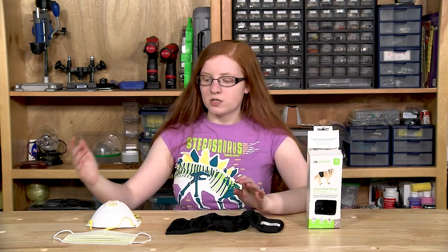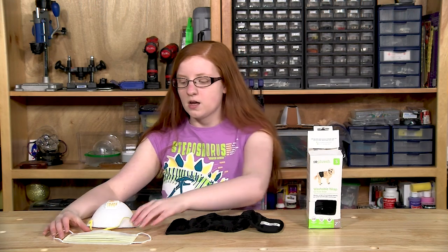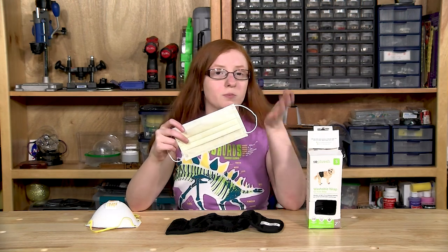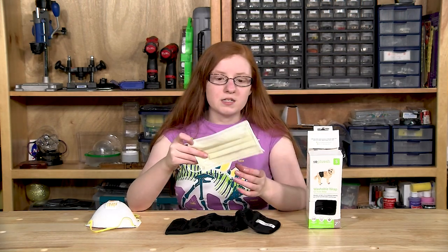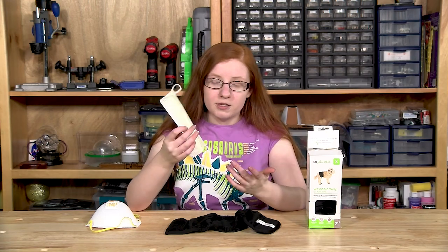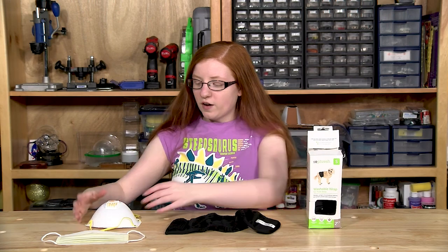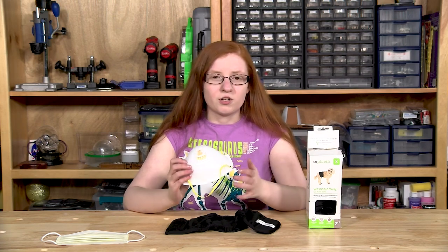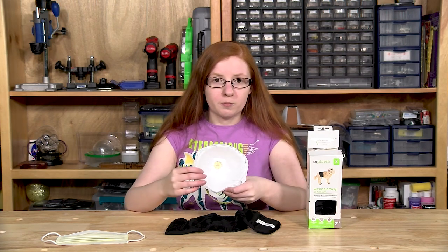The second reason why we wanted to cut into it is to see if there is something called melt-blown non-woven polypropylene. That is the same material that is used in surgical masks and N95 masks. A lot of people think these are paper or fabric, but no, it's polypropylene. A surgical mask has a layer of polypropylene, then a layer of fabric for bendability, then probably another layer of polypropylene. For the N95 mask, the outside is either fiberglass or a thicker form of polypropylene, and the inside is polypropylene — the same material as the surgical mask.